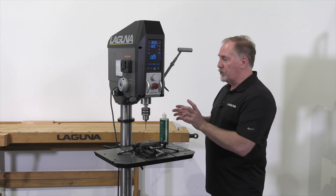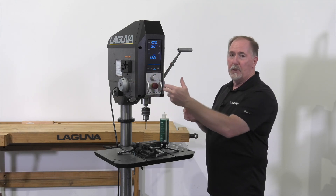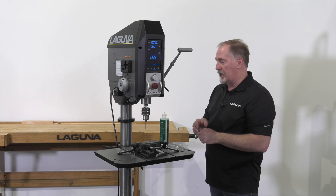One of the biggest things is to go through and refer to the drill speed chart either on the side of the drill press and the owner's manual, or in a machinist guide or the black book — that will give you that information.